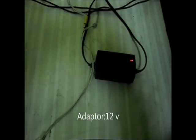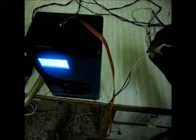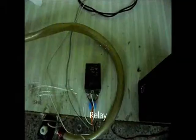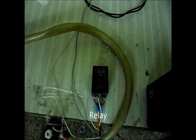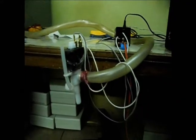The adapter is directly connected to the control panel. The output of the control panel is given to a relay, which will energize a 230V water dispensing valve.